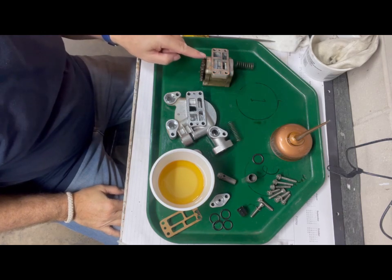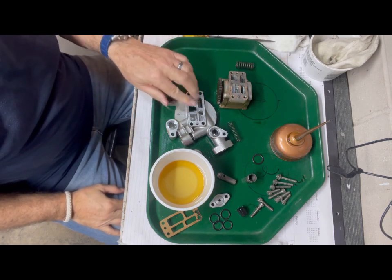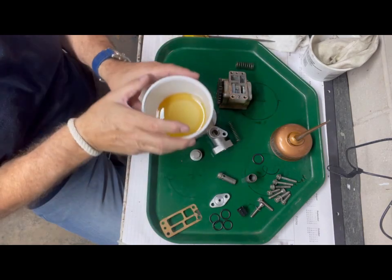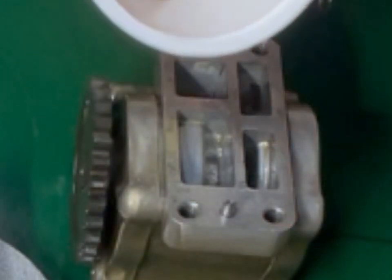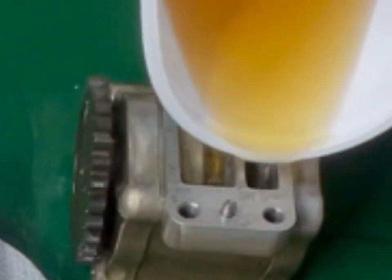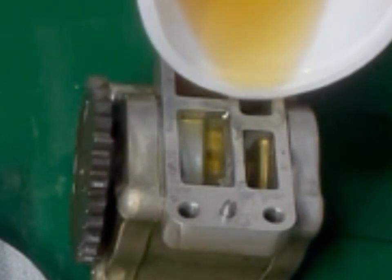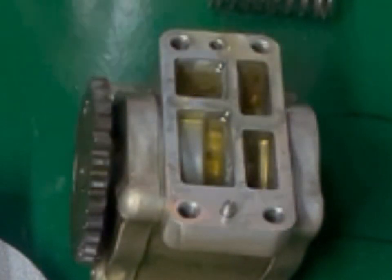I've been thinking about how to prime this pump. When this is ready to be assembled, I'm going to turn the pump housing over and put it on the pump this way, because I know something's going to spill out when I put it on the motor. The motor isn't really upside down, but we'll be pushing up on this to put it in. So I'll just fill it up here. Look at the air bubbles coming up.